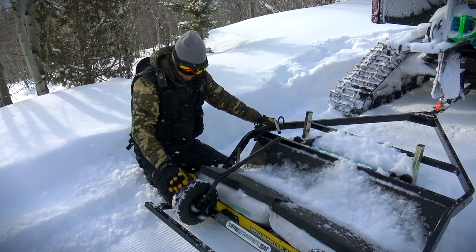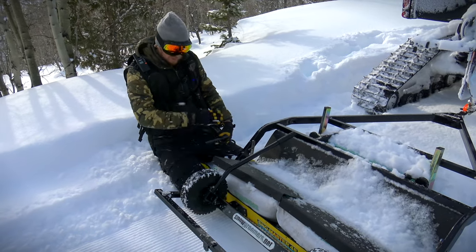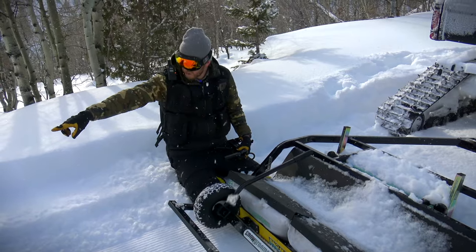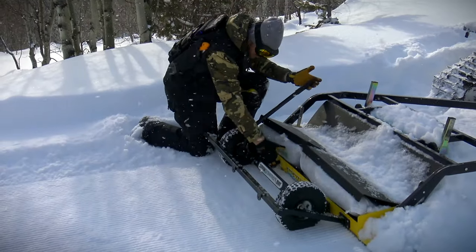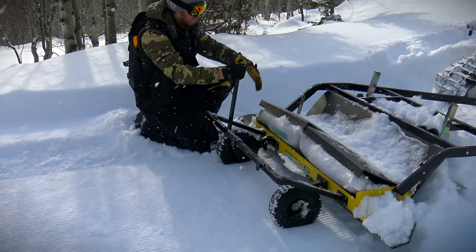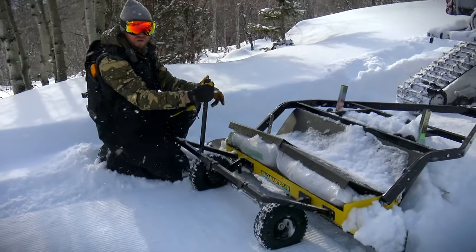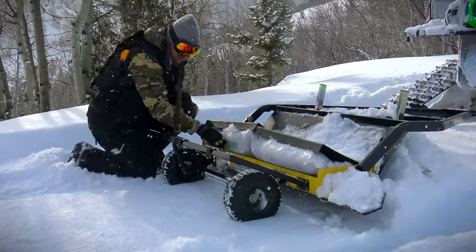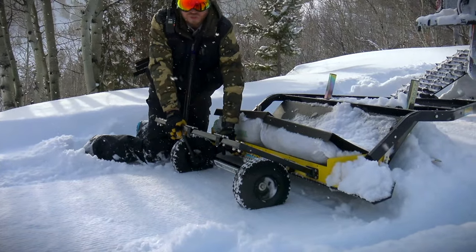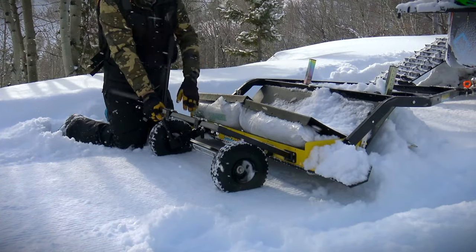The next thing is the wheel kit. Here's the wheel kit — it's in the out-of-the-way position. If your chassis is sitting too high, your tires will hit and you'll see tire marks in the back. Essentially, you just have a pin here to drop it down and it lifts the whole snow groomer up off the ground. This allows you to get over any non-snow surfaces, and also allows you to reverse — because if you decide to reverse without the wheel kit, sometimes you jam snow underneath these combs and can cause damage. So we don't recommend reversing without a wheel kit.